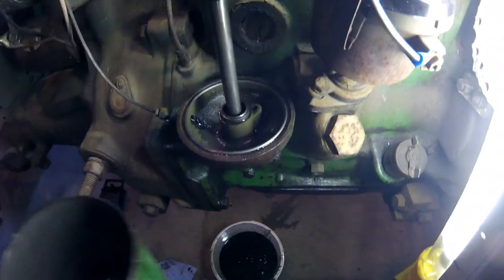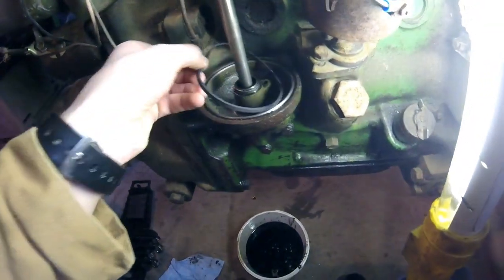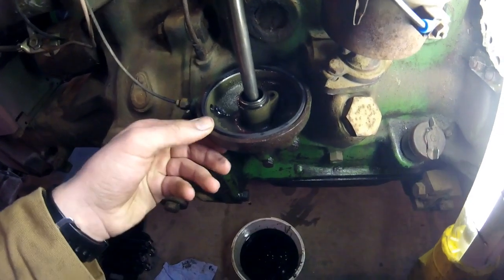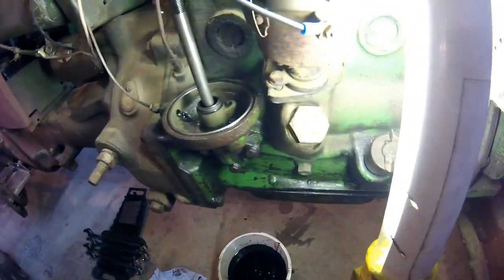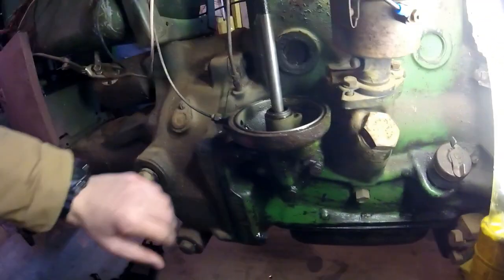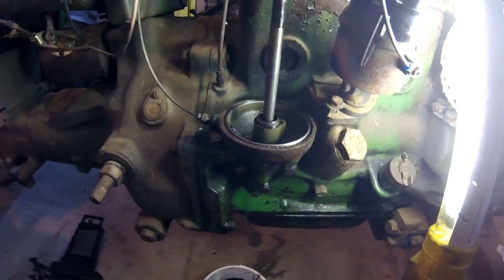There's no gasket. Now there should be a gasket that goes in this filter, and it's a little round rubber O-ring, kind of like this here, and it slides down into this groove. And there you go. And when you screw your housing on there, it seals this gasket. But there was no gasket, so it's a bit strange to me. But I don't know. Anyway, I have a gasket now, so I'll go ahead and get that fixed. But yeah, so there's a drain plug. Kicking myself in the teeth. Anyway, all right, I'll get that cleaned out and get the filter on this thing.